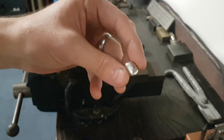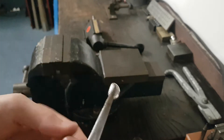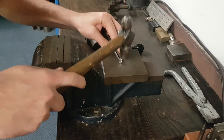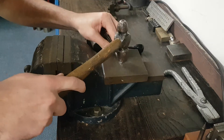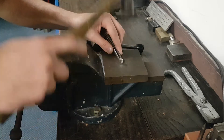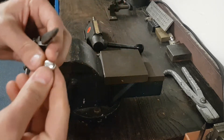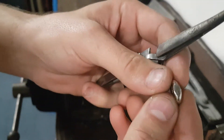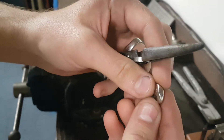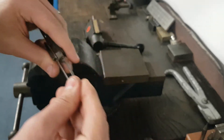So what we're going to do now is just hammer it and try to get a square bar out of it so we can take it to the rollers. We've got to try and hold it flat on here and slowly and accurately hammer flats on there and the back side to create a square bar. We've got to try and crush it back into itself one way.